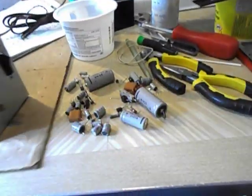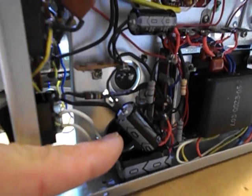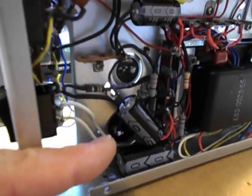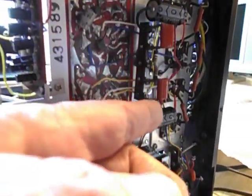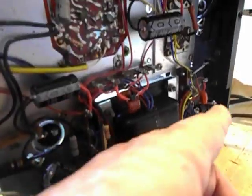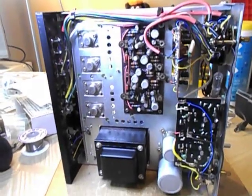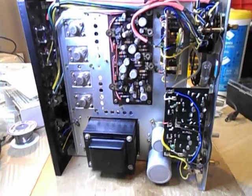Got a lot of stuff out here — I'm going to give you a peek. Down in here I put some capacitors under the board, under the chassis where there's room. You can see the new speaker coupling caps and the new Zobel network caps. Wherever there was an oil-filled cap, I replaced that. But if you look at the metal on this thing, it's just incredibly nice. Like I say, this was dropped in the box shortly after it was put in service and forgotten about.